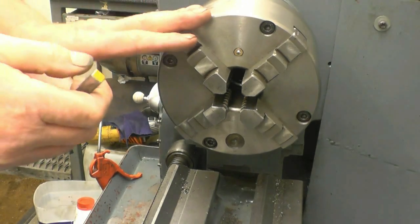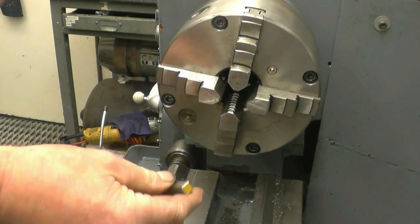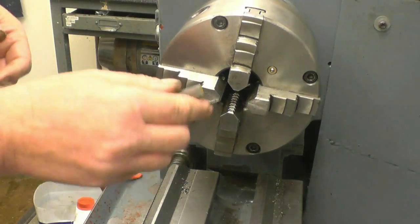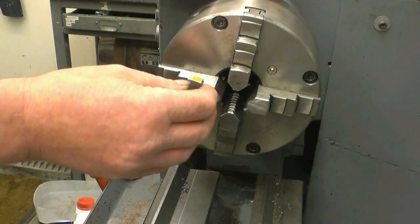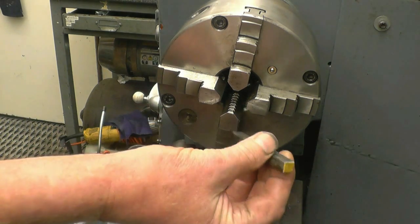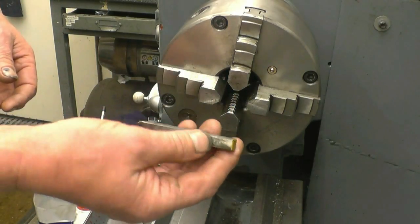To lock the eccentric onto the crankshaft of the steam engine, normally I'll just put a couple of cap head grub screws in. What I want to do is make a square headed bolt. They usually used a square headed bolt in the day. I've seen pictures of old steam engines and that's exactly what they used. I've got a bit of square steel here. It's actually an old tip tool, the end's been broken off it. I'm going to make it out of that.